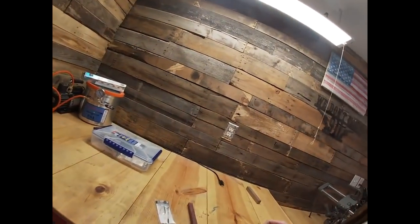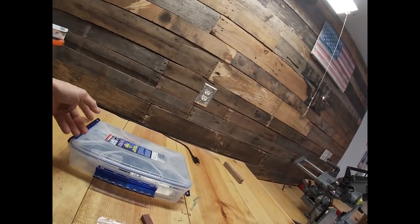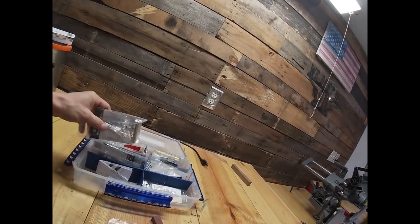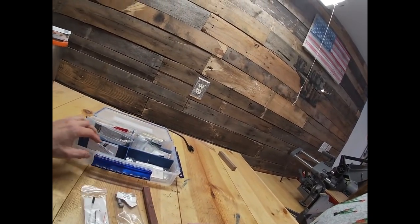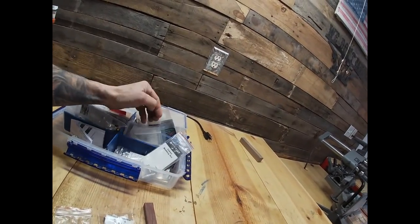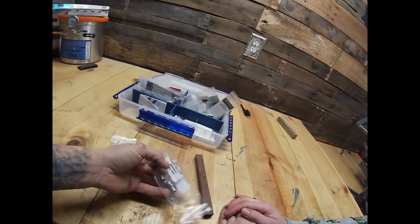All right, so we start out, we gotta get the right bushings. You already got your pen kit and your purple heart piece. Every pen is a different thickness at the tip and also the mechanism. So that bushing will help you turn it down to the right thickness to fit your pen. Everyone's got different bushings, so make sure you get the right bushing for your pen kit. It also tells you what bushings you need in your pen kit instructions. But so we need our Slimline bushings.